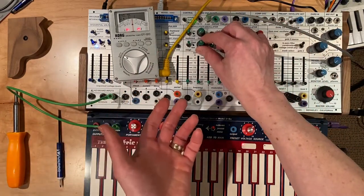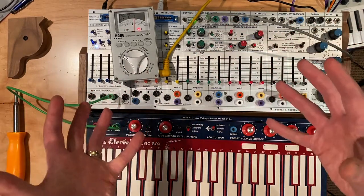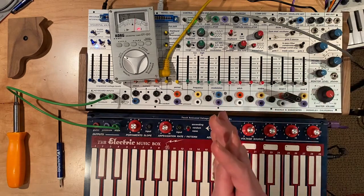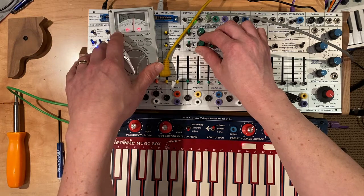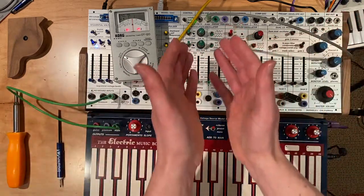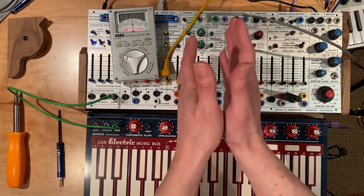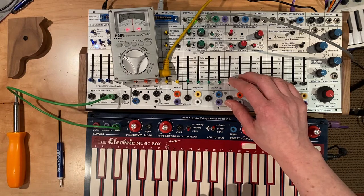The fine-tune knob is the thing that tunes. Because it's an analog instrument, you have to let it sit for a minute or two to warm up. After you've had your 208c on for a few minutes, it'll settle down, and then you use the fine-tune pot to tune — using a tuner here. It's not necessarily the middle; the middle is just a reference. This one's a little off-center. We tried to set it from the factory pretty close to center, but you'll need to use a tuner to know for sure, or your ears.